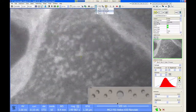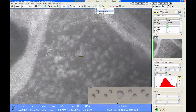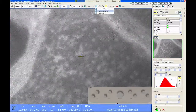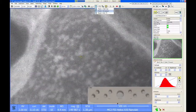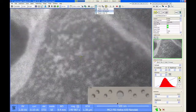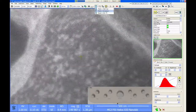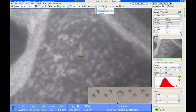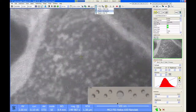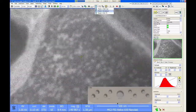There are three lens modes available to you. The first one is mode 1, field free. Second is mode 2, immersion mode. And then there's mode 3, EDX mode. However, there's only two objective lenses on the column. Mode 1, field free, is your low resolution objective lens. Mode 2, immersion mode, is the high resolution objective lens. And mode 3, EDX mode, uses both lenses at the same time. The EDX mode is used as a special case for doing x-ray analysis on some types of